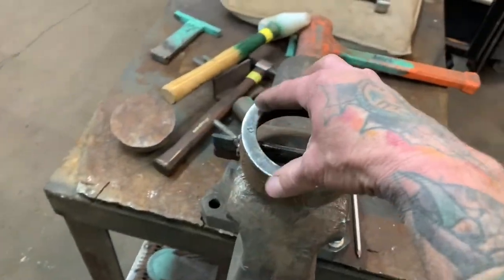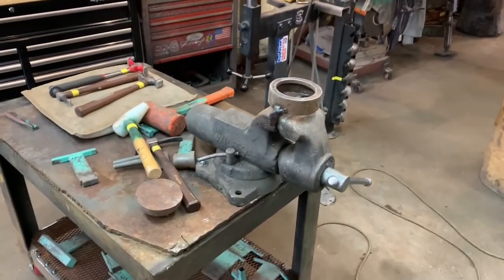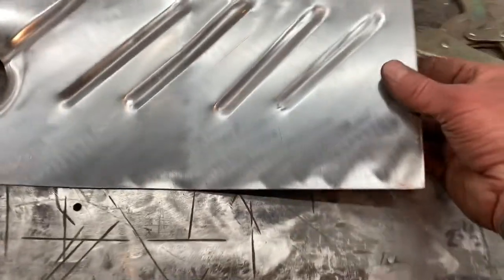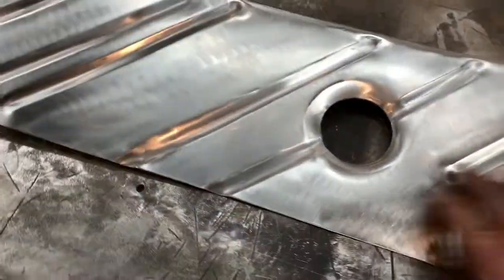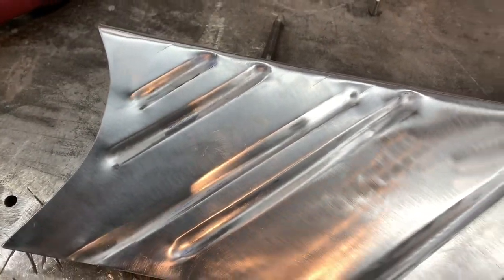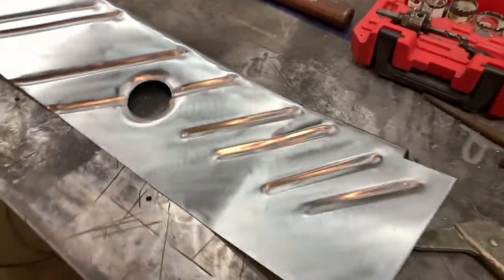That way you can make sure the lines get centered, and then I rolled the beads in there with the bead roller. I made the dimple die and that's how I did that dimple — it worked out great. Here's that piece all finished — just metal prepped it, hammered and dollied it, got it looking nice, and it's ready to weld into the trunk. That'll make it easy because it'll be nice and clean and prepped with no problems welding it. Thanks for watching.